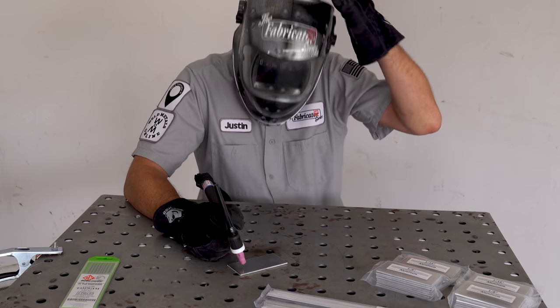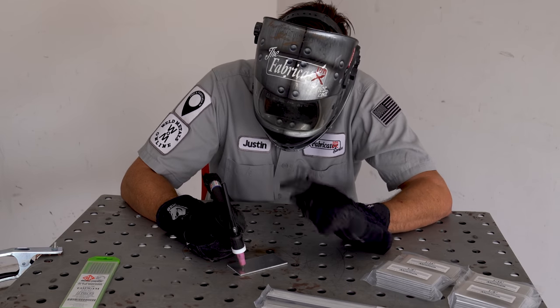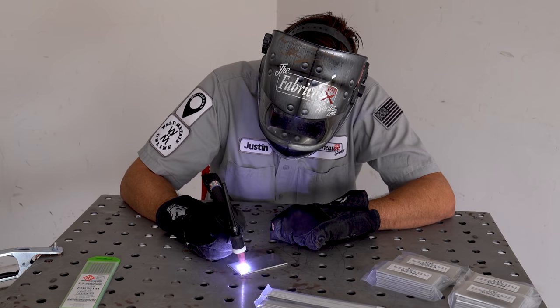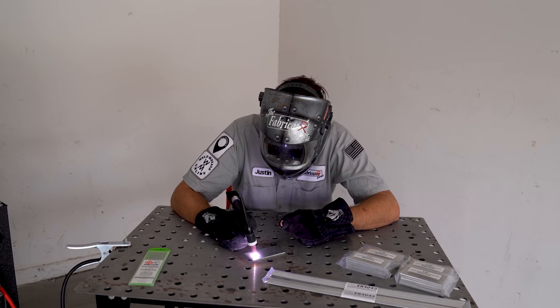Let's drop the hood and see what happens when we initiate the arc. I'm relatively close. I initiate, and you hear that sparkly, nasty, unfocused arc — that's not enough amps to keep it lit. So I increase slightly by stepping on the foot pedal, and immediately I see a bunch of ashy stuff. That ashy stuff is the oxide layer being broken up. Increase more and I start seeing little dots, little speckles — that's the oxide layer breaking up in the aluminum below it, trying to get molten.